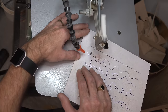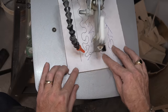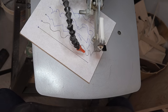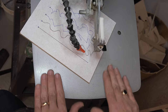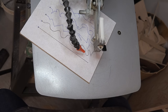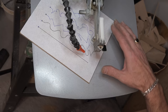Into this home stretch with a gentle curve, a tight curve, and then a straightaway — we'll stop it right there. If you're having problems rotating your stock, there could be resistance from friction on your table. For that, you can apply a little bit of paste wax and buff it up. Just don't use waxes that have silicone, because that can get into your stock and cause problems with finishes. Now that we've got that one done, let's move on to pattern three with sharp corners and 90-degree and greater-than-90-degree angles.